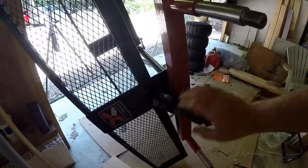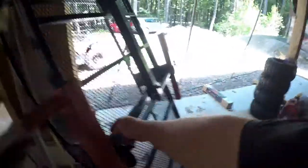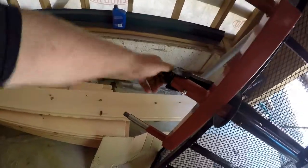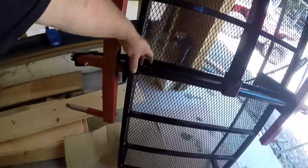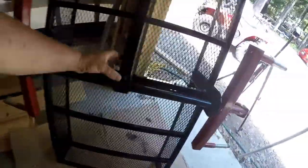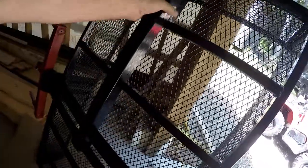We have these braces. Note these braces, how they attach here and bolt through into here. They go on the end of the spindle like this. This has not yet been tightened up. We will grease this pivot. We have this screwed in here. It was threaded, screwed in, and you put a bolt to stop it. We'll tighten that bolt. The entire drawbar assembly needs to be tightened, but is essentially where it needs to be.